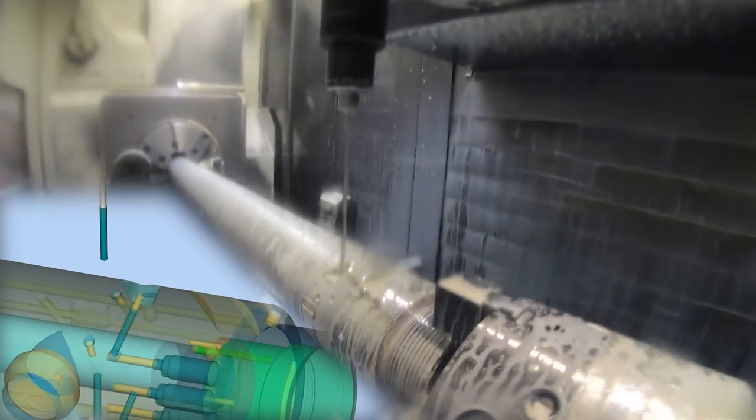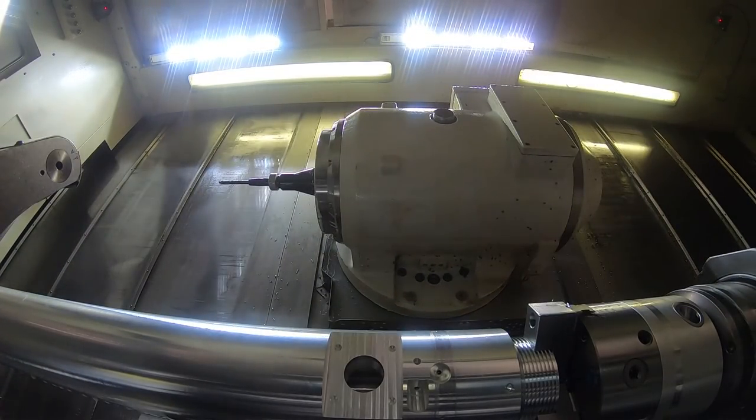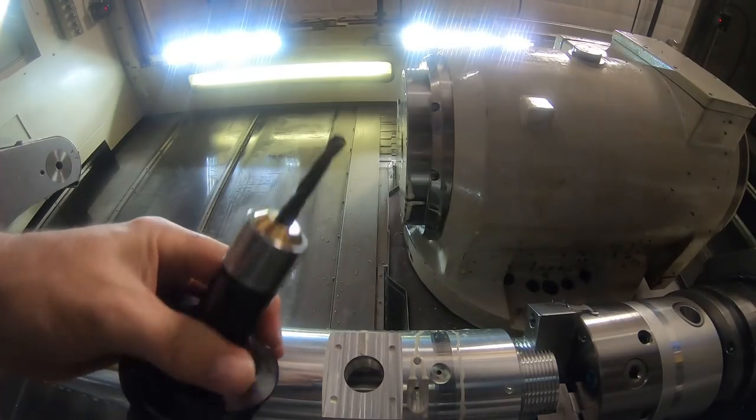But you don't want to drill a hole. Well, the basic thing is to drill the long holes before the short holes or any hole that intersects the side. It's all right if you're going all the way through, sort of bridging across the hole; that seems to be all right for the drill. But to drill a drill into a hole that's only got one side of the hole on the side of the hole is very hard on the drill and causes problems because it's an unbalanced cut on the drill, and it can chip the drill, particularly in materials like titanium.